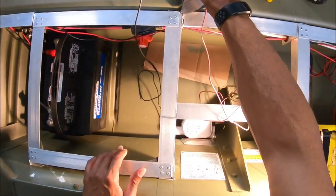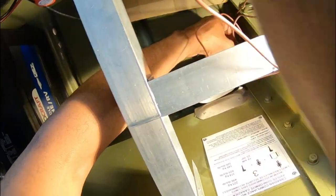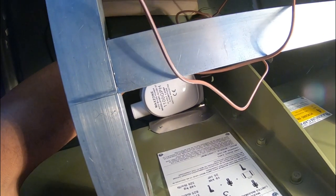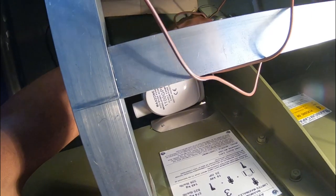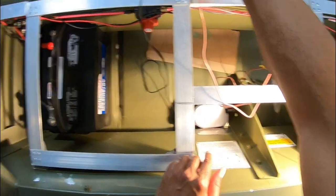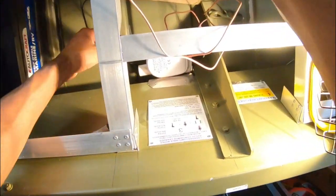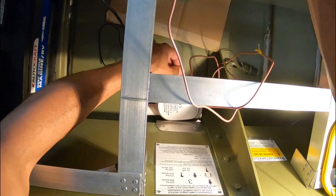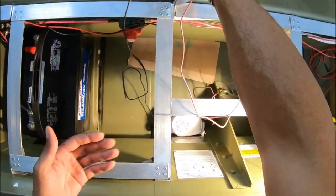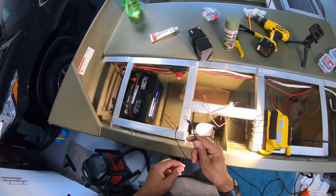The second wire will provide power to the bilge pump so that if and when water is detected by the pump itself it'll automatically pump it out. Connecting power to this wire alone will not do anything. There is a test knob on the back — if I turn it, it turns on. This is a good way to test that the automatic pump feature is working so you're not out on the water and next thing you know you're taking on water but your pump doesn't turn on. What that knob does is lift up the sensor as if water were raising the float.